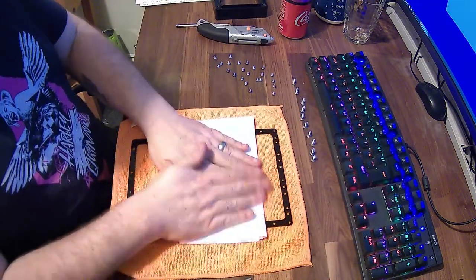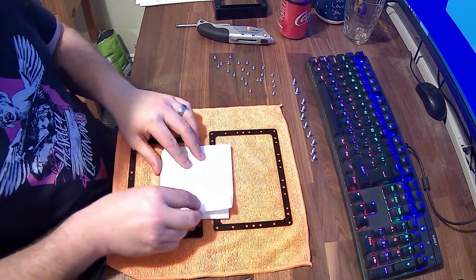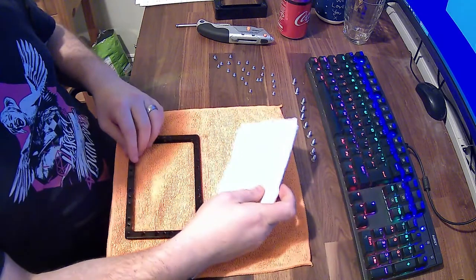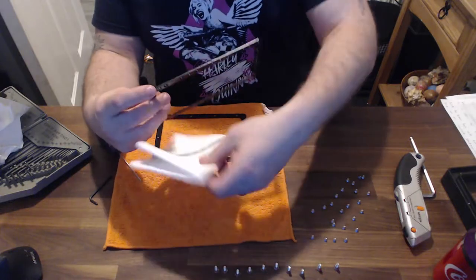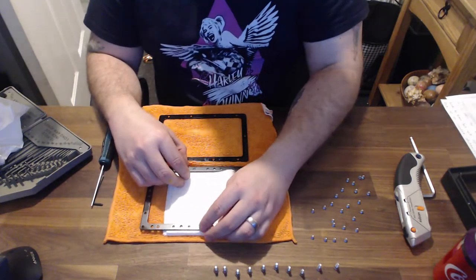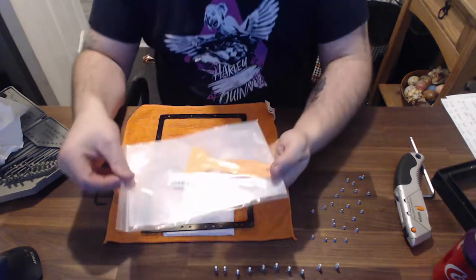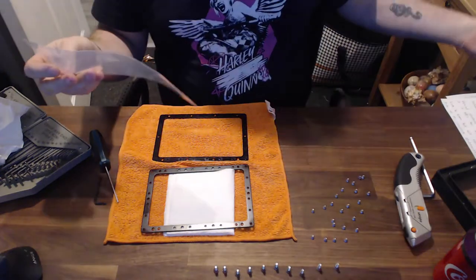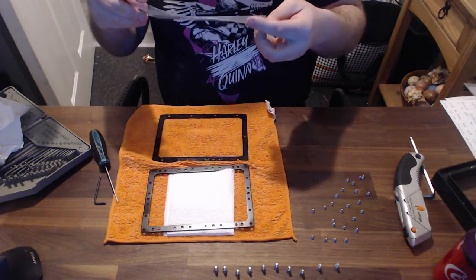I'm folding a piece of tissue — now a bottle lid is better, just a small bottle cap from a 500ml bottle or something like that, but I just didn't have one to hand. All I'm doing is putting that underneath to raise the FEP sheet up a little bit. It's not the best — a bottle cap works so much better — but this does work. This is essentially just to keep it a little loose, so when you tighten it up it pulls it all tight and you get the tension you need.